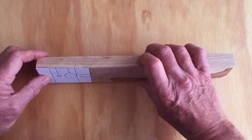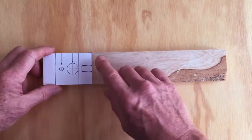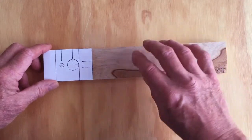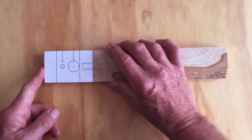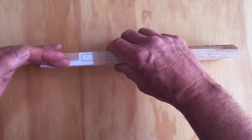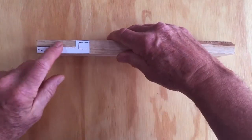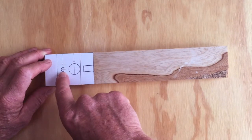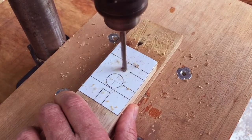I've got a piece of ash that's three-quarters of an inch thick, two inches wide, and about eleven and a half inches long. We're only going to be using the first three inches here, but we're leaving it long because I'm going to be putting it in my mortising jig. This is the front of the jig — the part closest to the wheel — where the knives are going to be clamped. Right now we're going to be drilling a 13/64 hole here and then we're going to tap it.